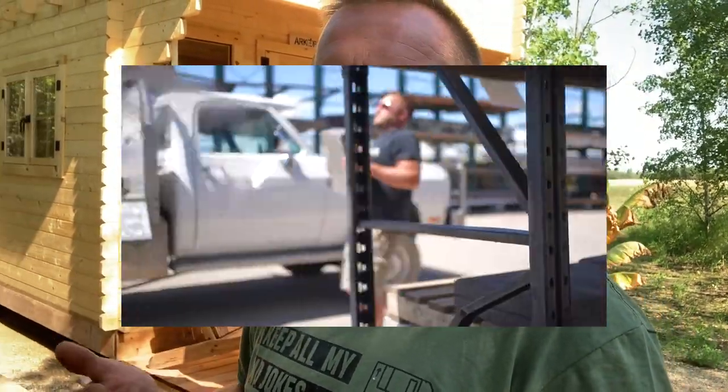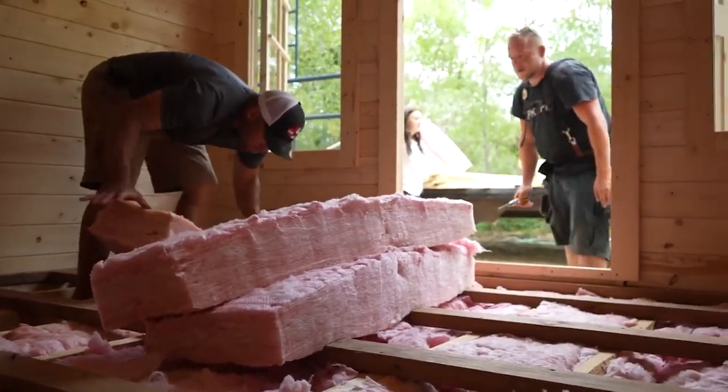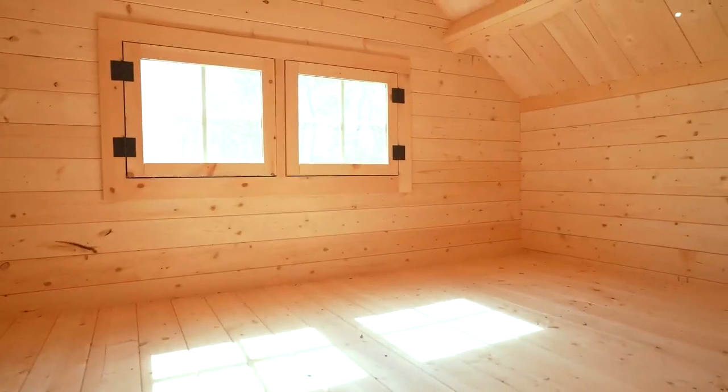Because I used two-by-six construction, I got two-by-six fiberglass insulation — just one bale for about $90 to $100 — and I put that in the floor. I didn't even bother putting a vapor barrier on the floor because the building is what it is. That R20 insulation in the floor is important because that's where all your cold is going to be. In a little thing like this, it's going to be hot up there and cooler down here — heat rises regardless of what heat source you use.